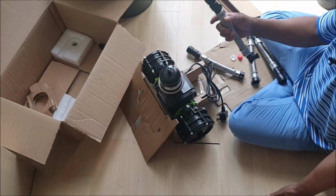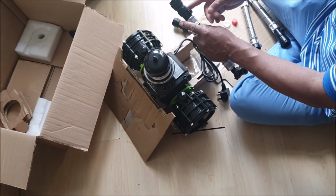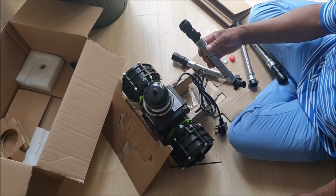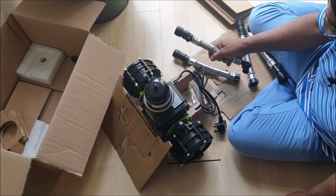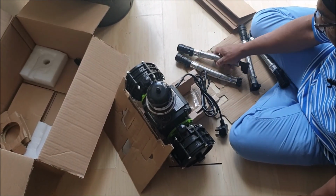Oh, while we're here, these valves, this little screw here, if you get your screwdriver and you turn it left or right, that opens and closes the valve. Let the water through or shut the water off. Okay, so if you're changing your tap, you just shut the water off, change your tap. But if you're going to shut the water off for the whole lot, you turn your mains off. So remember, before you start any of this, you need to turn your mains off.